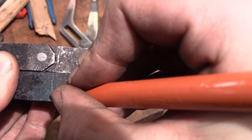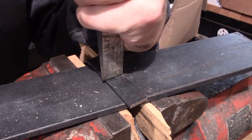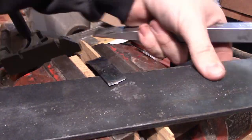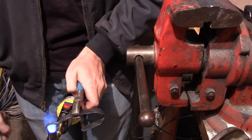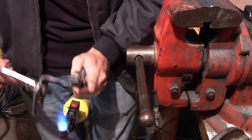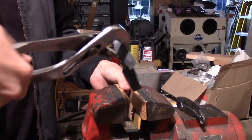Couldn't find any good pictures of any complete-ish iron scabbards like this, let alone the backs, so I don't know if it would have been common to forge weld these rather than rivet the ends together. In any case, I'm not good enough for that, so I just made sure to trim them to length with a chisel. Saw cuts in this particular material would be a dead giveaway that it was made with modern tools.